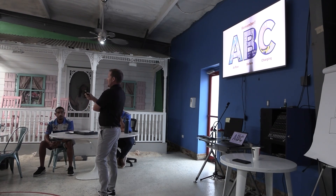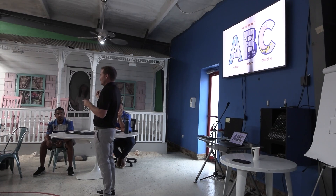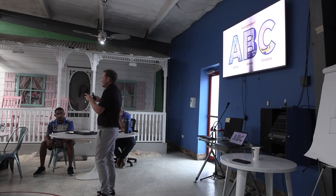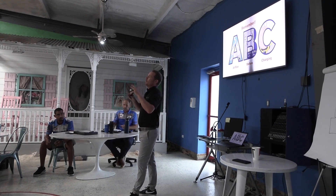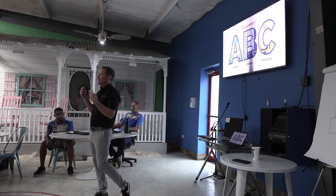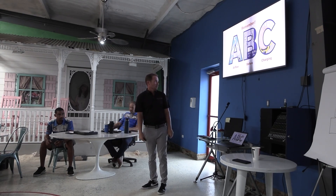I'm not saying you don't also look at your readings on the charge side to help validate airflow — you do. But it's about which comes first. It's much easier to set your charge if you know that your airflow is at least generally in range. There are a lot of things that can cause low suction pressure. You use charge to help validate airflow as well — it is a both-and type of situation, not either-or.